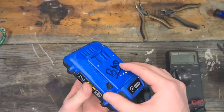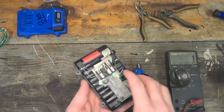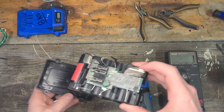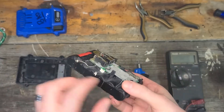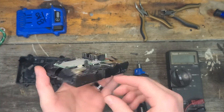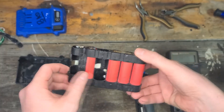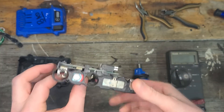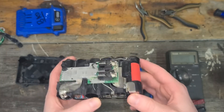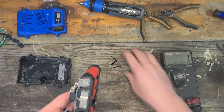This one is obviously bad, so we're going to look at what made it bad. This is probably what your battery is going to look like, mostly. This one already has some modification — it's been a donor battery before. There are strips on here, so if you're missing batteries out of it, then that's probably your biggest problem. This is a bad battery, so I took some cells out of it. The way I knew which cells were bad was just by taking my multimeter and testing them.